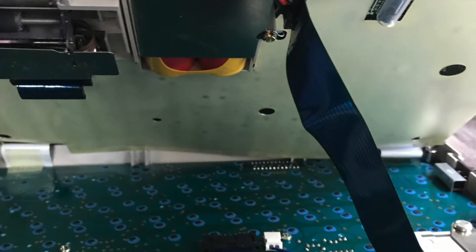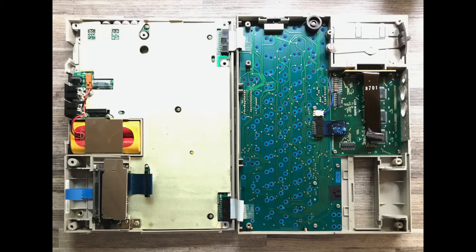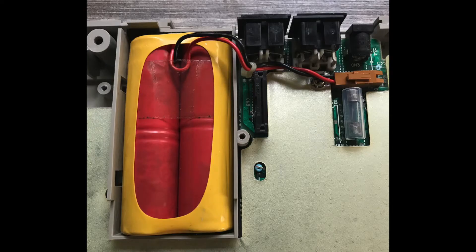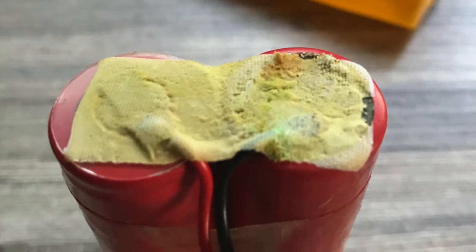To my horror, I saw corrosion on the LCD flat flex connector — I knew I was in trouble. After removing the connection for the ROM interface, I was able to separate the top and bottom portions of the case. The bottom houses the battery pack along with the main PCB. When examined, I could see discoloration of the batteries inside the sleeve, indicating the batteries had leaked.